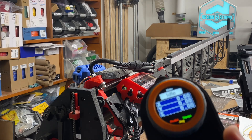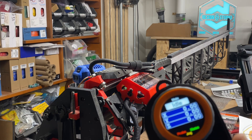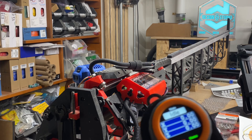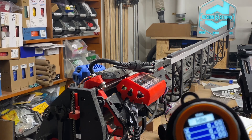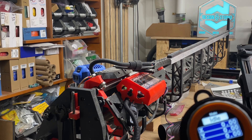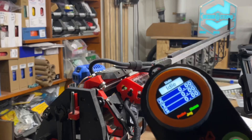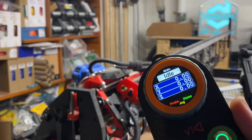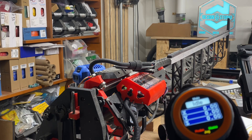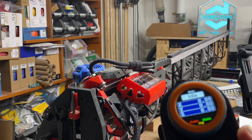In specific, why several folks are warning me against zeroing out by use of G-code G92, and whether or not use of G-code G10 might be better. Before I actually do the test of whether the hard limits and soft limits can survive setting a different zero with G10, and presumably that's what zeroing with this FluidNC pendant would do, let me first show you what the soft limits and hard limits look like for not using any alternate zeroing at all.